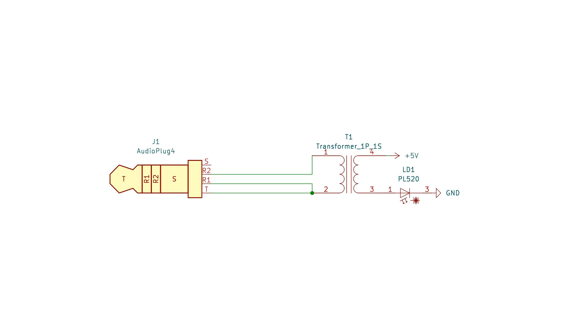Here is a schematic for the transmitter. It's quite simple. The audio comes in through a TRRS jack from a microphone, phone, or whatever else you want to use. That signal is passed through a transformer, which removes any DC components from the signal. The other side of the transformer is in series with the power supply for the laser. Because it is coupled with the audio input, it modulates the intensity of the laser beam, encoding the audio. The hit signal from the zapper is already an audio output at this point, although I run it through an amplifier to increase the volume.